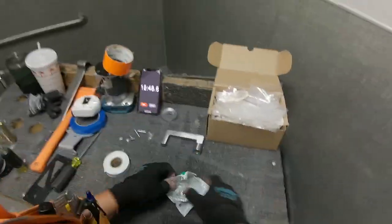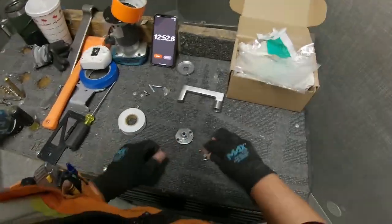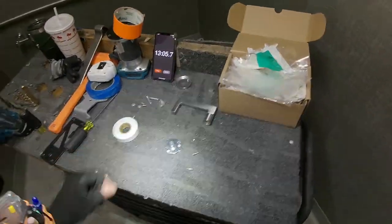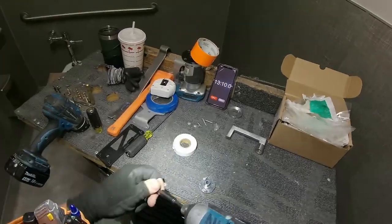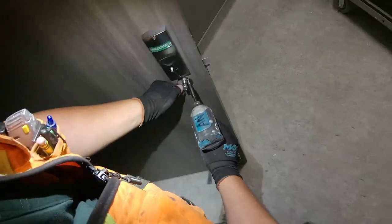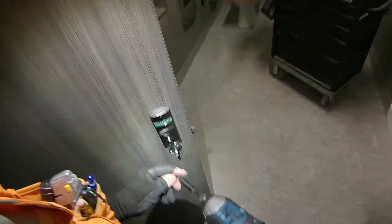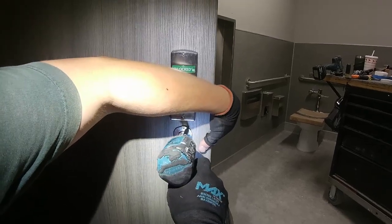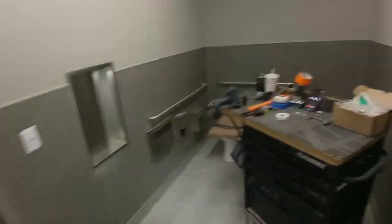Then we're gonna do the inside. Here I mess up something else again. There's a little notch on that post, and I put that notch the right way. It goes towards the inside because there's a set screw, but on this piece here there's a hole that's threaded for the set screw, and I actually installed that backwards. So you're going to see me take this back apart once I realize that I put it in wrong.